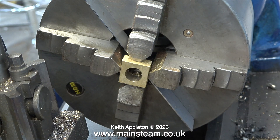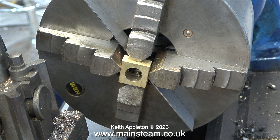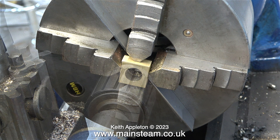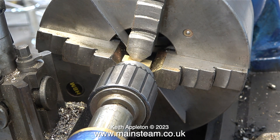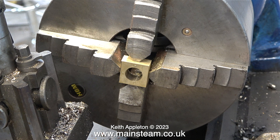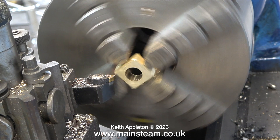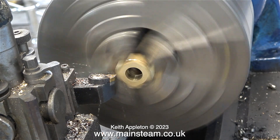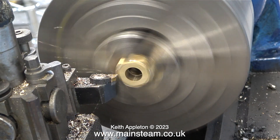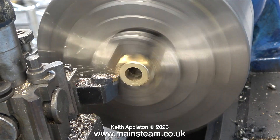For the next operation I'm going to show you this four-jaw self-centering chuck. I put a ruler behind the block to make sure it fits in there squarely, and I'm pressing it into position against the ruler with the tailstock. This method works, but for the thickness I finally need to reduce these down to it's going to be a bit risky at this stage.